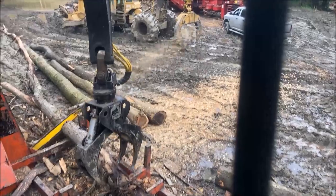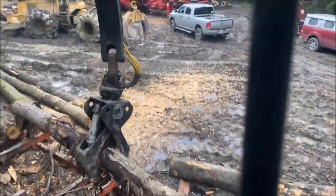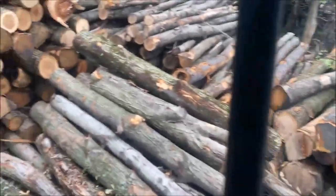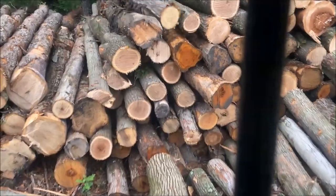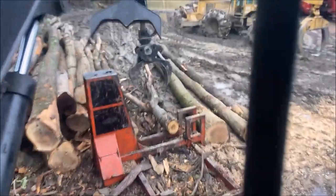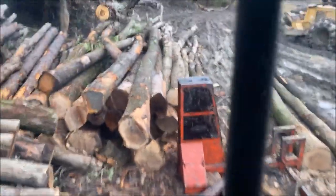I look at it as he can chop two fairly straight 8-footers out of that. Can't go anything shorter than 8s. Probably get an 8 out of this end and a 12 out of the other. It's 20 foot. They'd leave a little room for trim if they need it. But you can't go shorter than 8 because of the head rig. They don't have the type of scrag mill. They run everything on the head rig and the blocks won't be able to grab the log running through the mill. Set that over here.